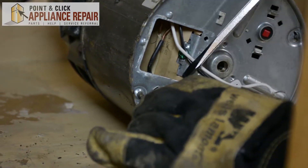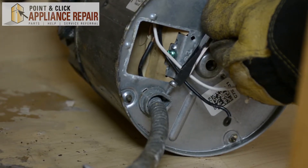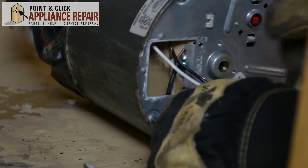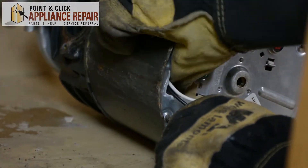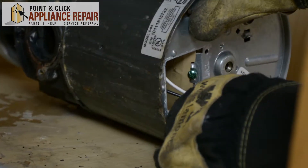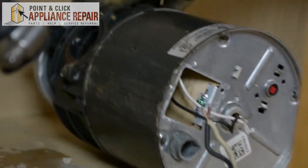So we're going to have to get these out now. The next thing we're going to do is loosen up this screw here. Once that's loose enough, it should just pull right out. With these wires here, they're a bit rigid, so we just have to bend them so they're straight, and then we can pull them out. And now we'll get rid of our old disposal.